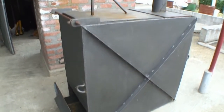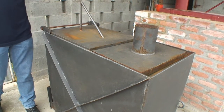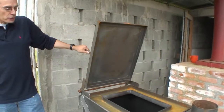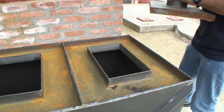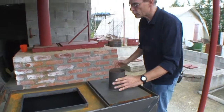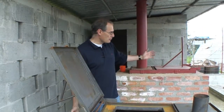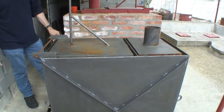What we see here is what we call the intermediate burner. The concept looks very much like a De Montfort incinerator, with the difference that the core is not made of refractory bricks and cement but is completely made of thick plated steel. Otherwise the principle is completely similar — there is again a loading door with a sand seal, and with the chimney spigot removed you can clearly see there is a secondary combustion chamber with a tunnel between the primary and the secondary. This model is more conceived for post-emergency interventions: where a De Montfort would be for long-term, stabilized situations, this one can be reconstructed in places just after the emergency phase.